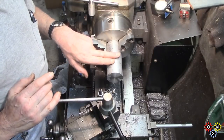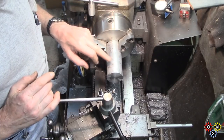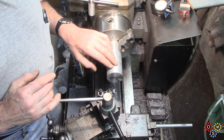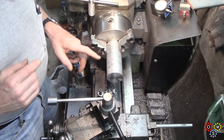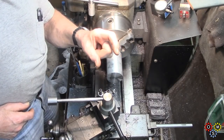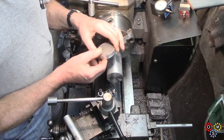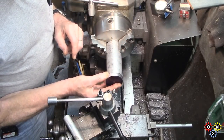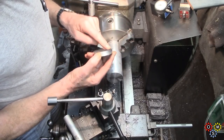Well, in the absence of any thick-walled aluminum tube, we're going to use this 2¼ diameter 6061, which was kindly sent to me long ago by Bill Lewis. There's going to be a bit of cleaning up, a lot of boring out, and it's going to finish up probably just under the 2¼. To close off the bottom later when we've bored it out, I've got this slug of aluminum which was spare from another job and should do quite nicely.